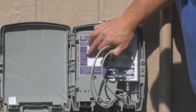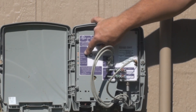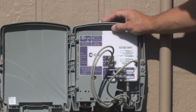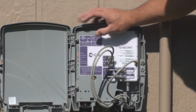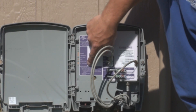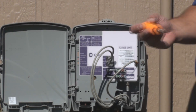There are also lights on this card. The power and transport lights have to be on and solid. The off-hook light — if you have a phone that's off hook, that light will be on. The CPU light is going to flash on and off pretty steady. The on-battery light — if that light is on, your battery is on battery backup, so it doesn't have power to the ONT battery. And then the RF video light will be active if you're subscribed to our TV service.